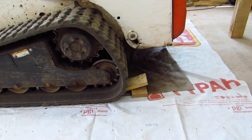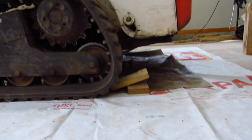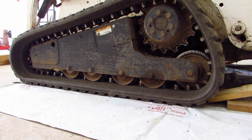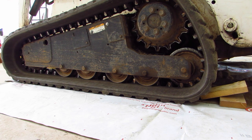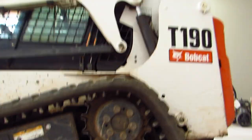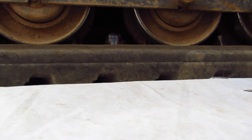All I'm doing is making a little ramp. What I'll do now is back the machine up and that will pick the back of the machine off the ground. Then I'm going to block it and pick the front up with the loader arm. You don't want to get your machine too high in the air when you're taking your tracks off, because what happens is they droop down and puts more pressure on your sprockets and idler in the front, making it harder to get off. All you want to do is get it off the ground enough so the teeth here will go underneath these idlers.